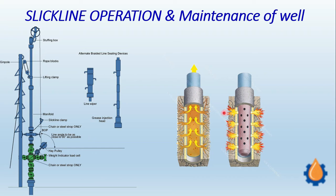In that case, we can see there is an explosive fracture, and this fracture will open up the pores in the hydrocarbon reserve. This is the rock, and because of the explosion we can see that it is opening up the pores inside the reservoir and the hydrocarbon will start flowing into the wellbore. This is one of the maintenance activities; like this there are several others and we need a separate topic to discuss them.